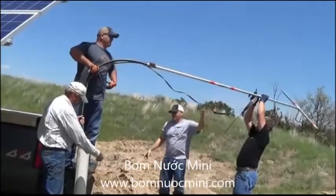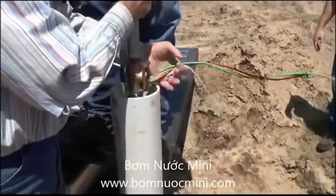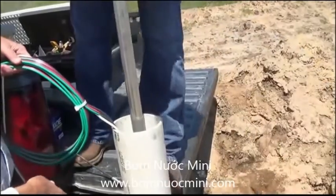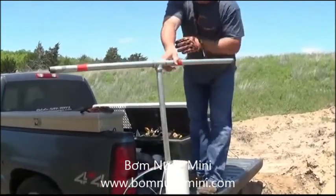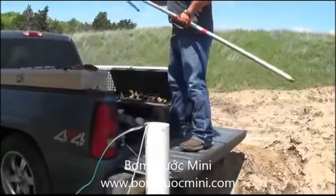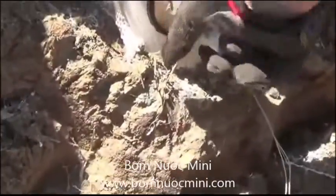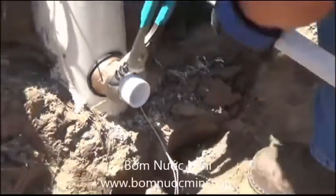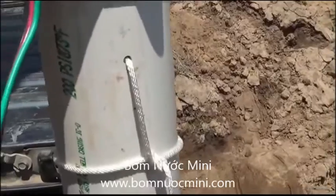We have made it to our T-pipe that will allow us to slide our interior piece of pitless into. Now we are going to cut the slot, find the groove, and it just slid into place. We are unscrewing our T-pipe out of the top of our pitless adapter — we got it slid into place. We've got our wire and our rope here to attach the wire to the pitless. Now we are doing our plumbing and attaching our one inch fitting. We drilled a small hole in the side of the casing to run our safety rope out and attach it.